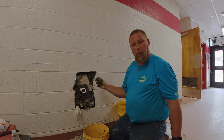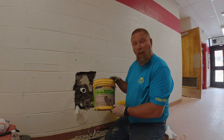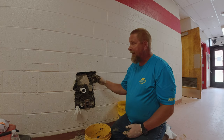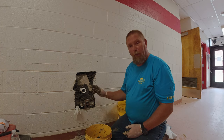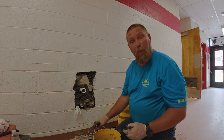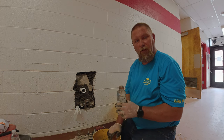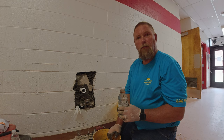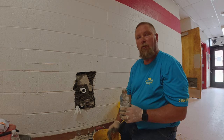To bring that heat down from this quick-dry hydraulic cement is going to take a little bit. Then tomorrow we'll be able to anchor up top here with our support bracket so we can put that drinking fountain up and hook it up. One thing I forgot to mention: when you put your water in this hydraulic cement, make sure it's cold water because cold water gives you a little bit more working time. If you put warm water in there, it will cure within a minute or so.